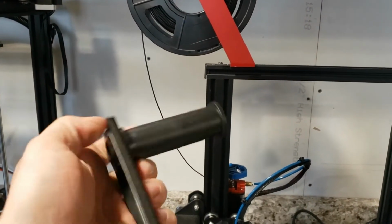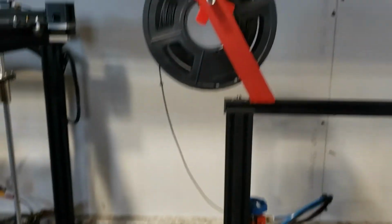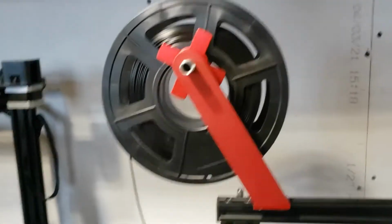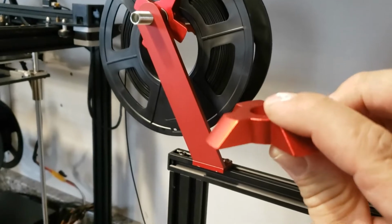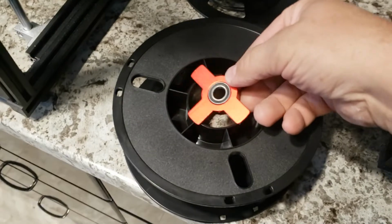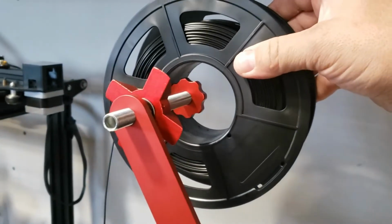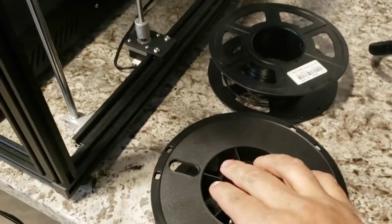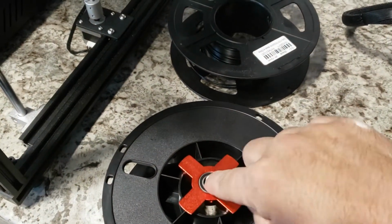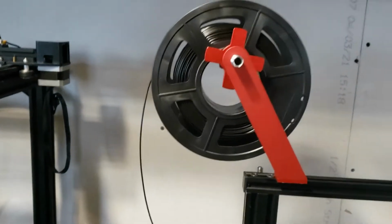So I've seen some designs where they put a bearing in here, but it's still not the size of the spool. So I ordered this one because it's made of aluminum. It was really nice. It has ball bearing rollers, and see how they're angled. So what this should do is it should sit in here, and when you tighten this down, it would go on the other side of this, and as you tighten this down, it would center it and pinch this and then sit on the roller. So this would roll really smooth. But I ran into a problem.